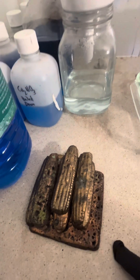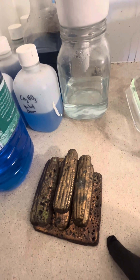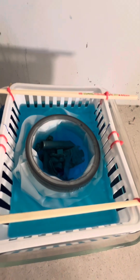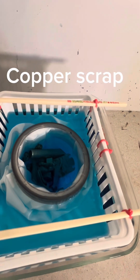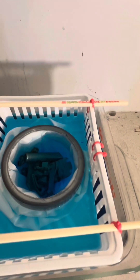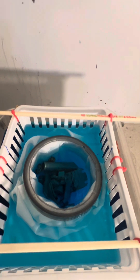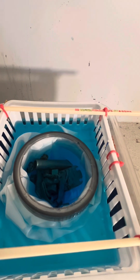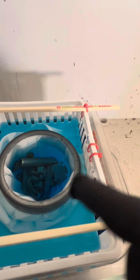These were the copper bars that I poured in some of the very early videos, and the copper brain corals also. We have some scrap copper that I pick up around the job site and around my house, and some silver left on some of the contacts and small breaker pieces. We're going to separate that silver into slimes and put the copper in the anode basket.